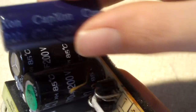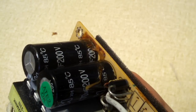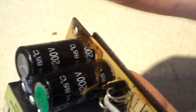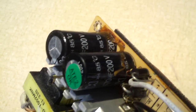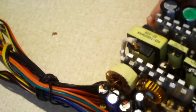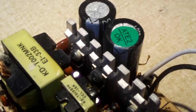As you can see, 470 microfarad 200 volts. They're the same voltage rating, so you'd expect them to be the same size. The caps get bigger as the capacitance value goes up — a 470 microfarad 6.3 volt cap is really small. Let's go ahead and move on. I already focused on the primary side, but I'm going through this again for those who haven't watched my prior video.